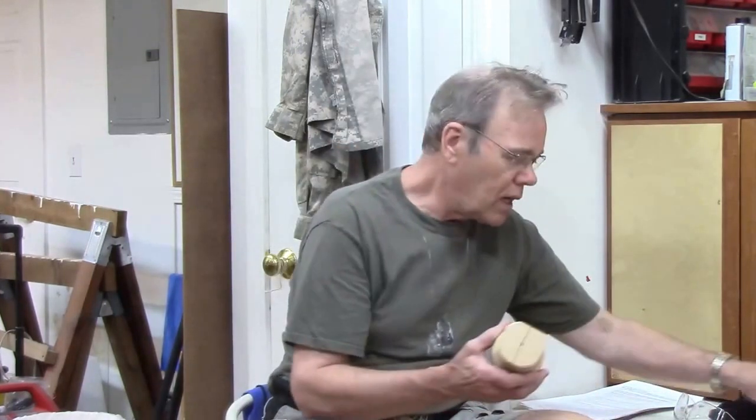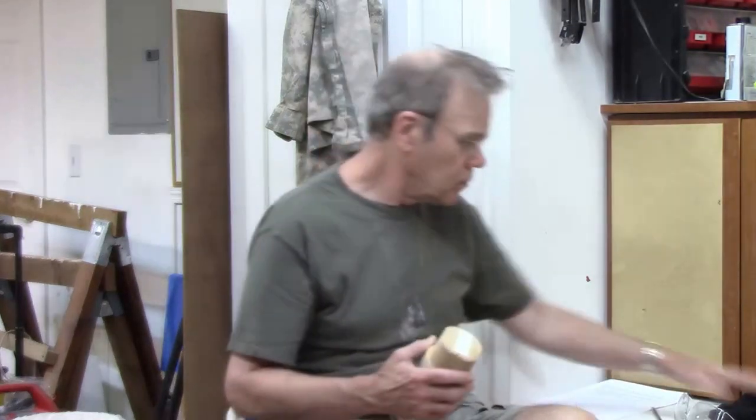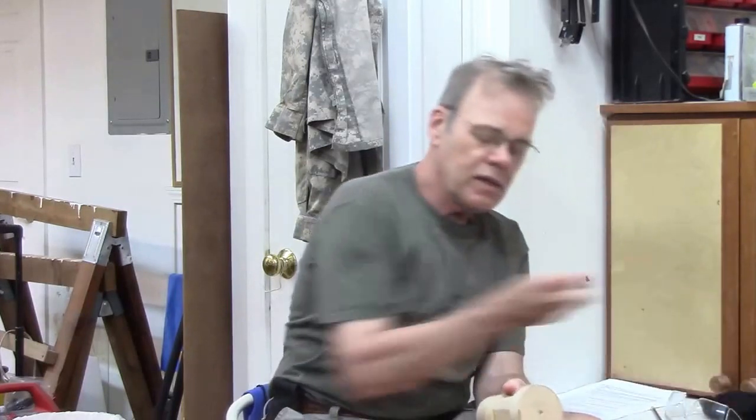So what he's saying is: when you have a glue block like this, you cut a little slit — I did this one on a band saw but a table saw works fine — you have your double stick tape on here, you've got an item double-stick-taped to it, and then you have a tiny allen wrench or finishing nail that fits in the slot. You just kind of lift up and it gives you a pressure point — gradually apply pressure and off it'll come. That's a nice tip, Ed.